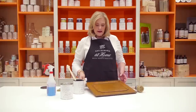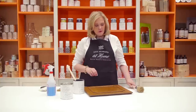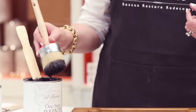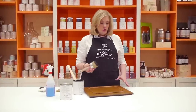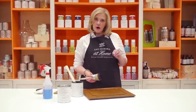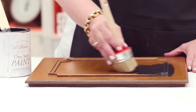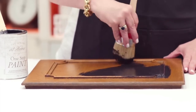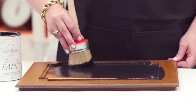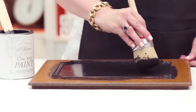Now I've made sure that my cabinet door has completely dried and I'm going to start painting. In this video, I'm using one of our hog hair brushes. You can use a china bristle, you can use a synthetic brush, or you can also spray this on — cut it about 20% with water, put it in your airless sprayer and spray it. You'll notice as I'm applying this, I'm doing some cross-hatching. I don't really want to be showing the tool marks, so I'm actually going in different directions.